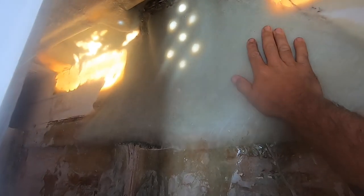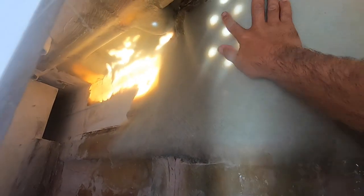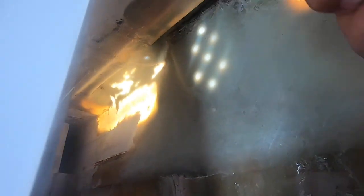That is beautiful. Look at that, guys. Three solid layers of the thick woven roving glass, and we've put a huge epoxy plate on here. So now we can put the stringer back in, tab it back into the hull, right down, tab these ones in that had the damaged tabbing, and this repair will be done. That looks excellent. Let's go check the other side.